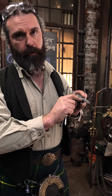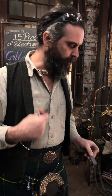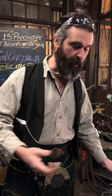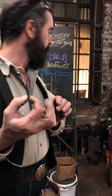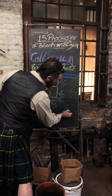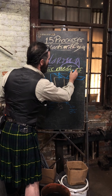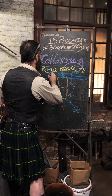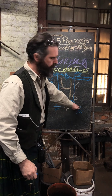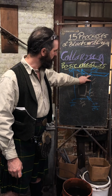So as it folds here, it's going to elongate, or it's going to shorten around this corner. So as it folds up, you got to add that extra material for the corners, which is going to be half your material thickness for every corner that you fold. So this is 1/4 inch thick. So what I'm getting is the addition of here 1/8, 1/8, 1/8, and 1/8. So 1/4, half on top of my 3 1/2. On top of my 3 inches. So 1/2 inch, 1/2 inch, 1 inch, 1 inch.